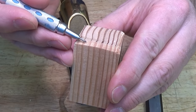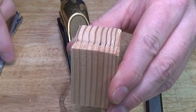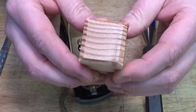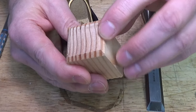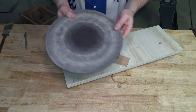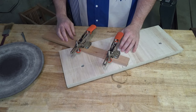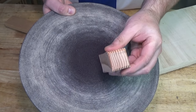Also, the wood can be very soft and even with a sharp tool you can get these areas where the edges just compress the wood. Also, I'm still learning to use hand tools and I think you can probably see that these chamfers are just not consistent. I don't think there's any way I'll achieve the results I'm looking for on all 36 chamfers by hand. Instead, I'm going to use my 12-inch disc sander in combination with this fixture that I created for a previous project. And with sanding abrasives, I'll have far less chance of splintering the wood and crushing those soft grain fibers.